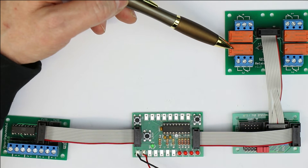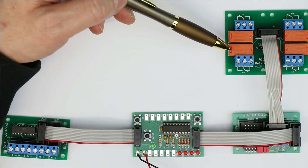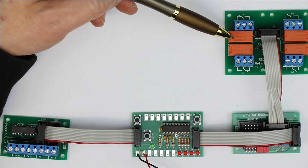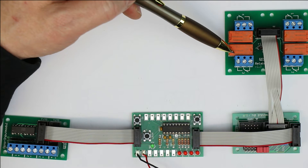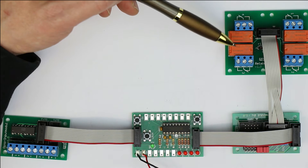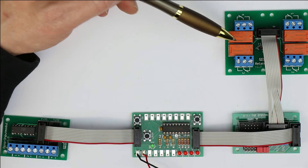I've already mentioned this a few times with our Uni-REL universal relay interface and our RIST programmable interface, and there is even a tutorial about the limitations of all relays you can buy. For switching DC resistive loads there's no problem with the 8 amp limitation, but watch out when switching inductive loads — you should not use the full 8 amp rating.